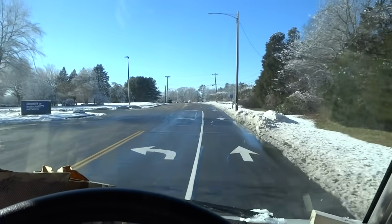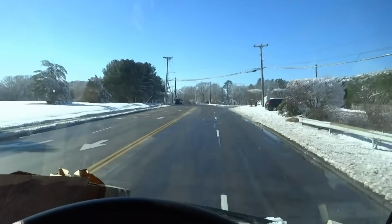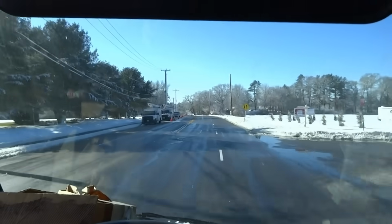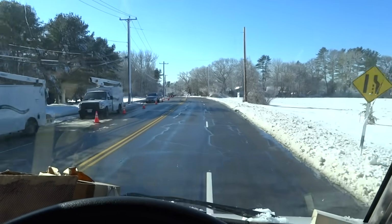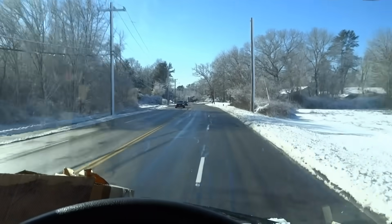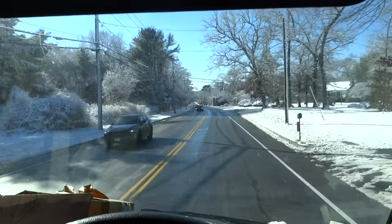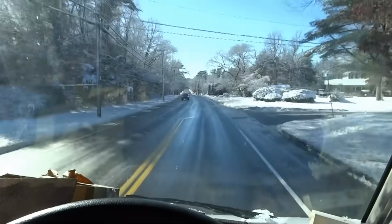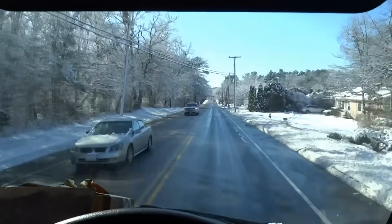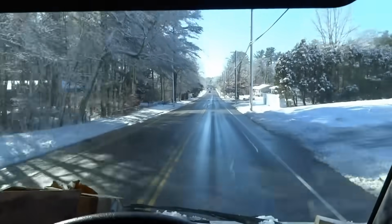It's not that far from my shop, so I'm going to try that. I got a new generator pilot assembly type of thing that goes in there. I got a couple of them in the truck for the Bradford Whites. We're going to try that out. It could be the computer board in that gas valve that's bad too. We'll be able to tell once we change the generator if it's still an issue. It would be the board.